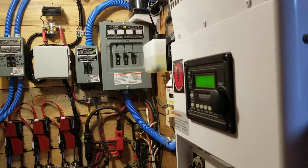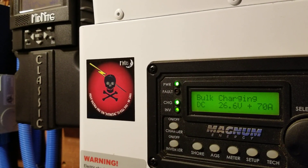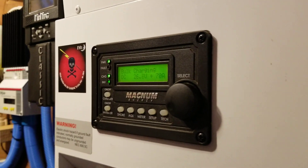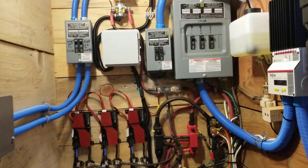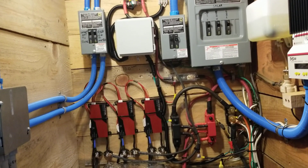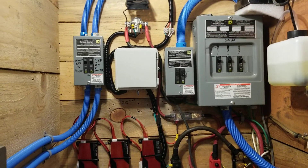If your battery bank was down for maintenance and you wanted to start your generator, this little button right here turns the charge off and allows power to just pass right through. I hope that helps somebody — I've had a couple of questions on these lately. It's been five and a half years since I set up the AVR SX460 automatic voltage regulator on that Yanmar diesel generator — MEP-016D I believe is the model. That's probably enough morning generator stuff.